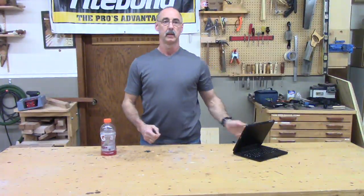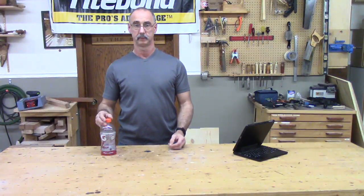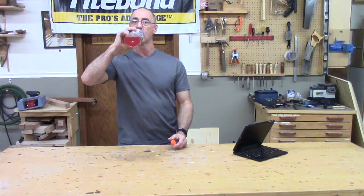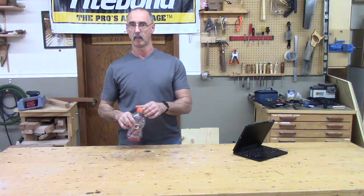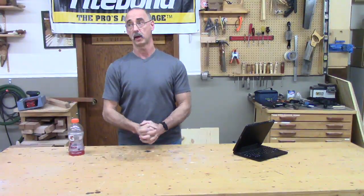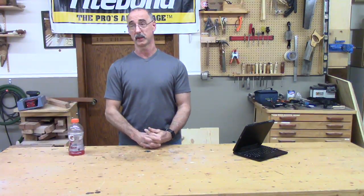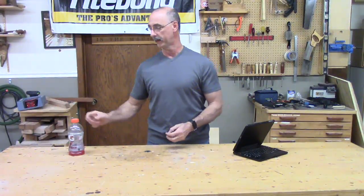So Tom says he built a decorative mantel around his fireplace using poplar and birch plywood. The poplar trim around the fireplace is joined with Kreg pocket screws and a minimal amount of glue on the butt joints. He got a slight separation at several of the joints after several fires. Any idea on the cause and how to avoid this in the future? The heat of the fire made the wood dry more, I'm going to say, and it shrank away from the joints. So that's tough. You're building something over a working fireplace. The wood's going to get warm. The wood's going to dry. I'm back to make sure the wood is in your shop for a while and gets completely stabilized, so that hopefully that won't happen.